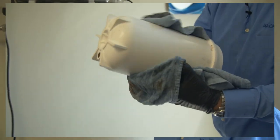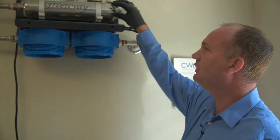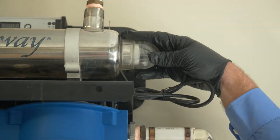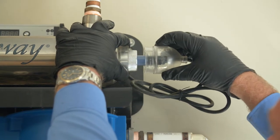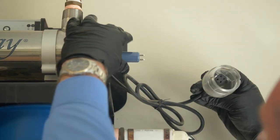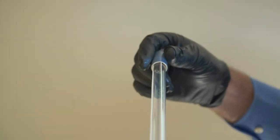With the filters off, this is when I like to do the light because I know that my water pressure is off, or else we'd be getting soaked right now. There's no pressure built up in this chamber. Next, we're going to remove the UV lens — this is just to show you that the light is on and working. It's a quarter twist and pull to expose the shell of the light. Remove the electrical. You can discard this; it has trace amounts of mercury in it, so you may want to dispose of it properly.